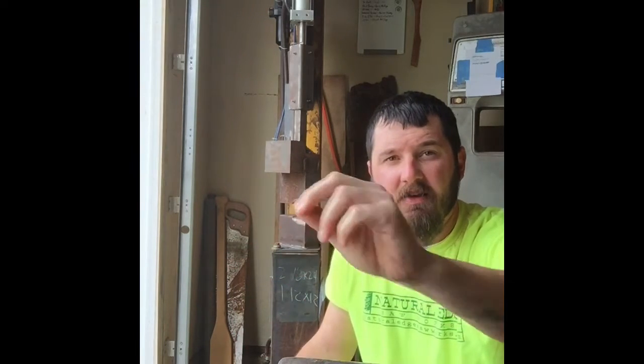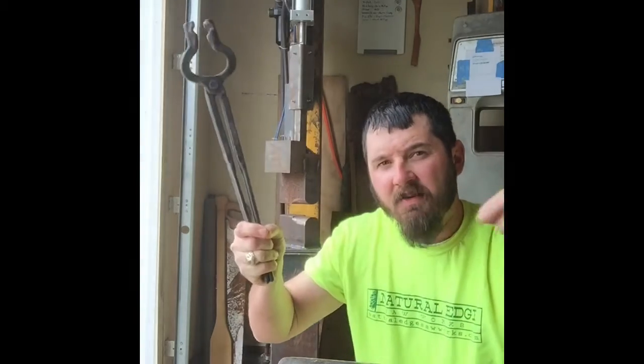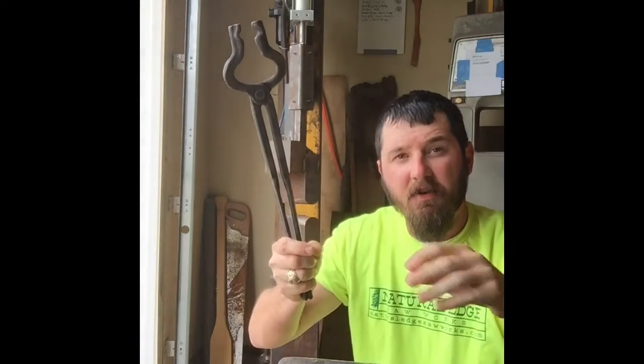So thinning everything out worked pretty well, but what it's done is straightened my edge, because we were thinning the spine, which is where we were getting most of that thickness from for the metal. Because we stretched that spine, that widens and that starts to make an arc in the spine, which has come around and has straightened the edge. The edge is where I want that little bit of a curve, because with a chef's knife, you want it to rock as you chop into something. You don't want a straight, flat edge.